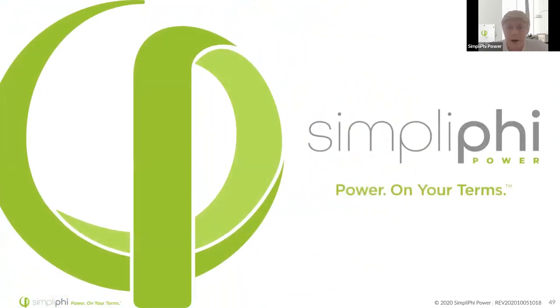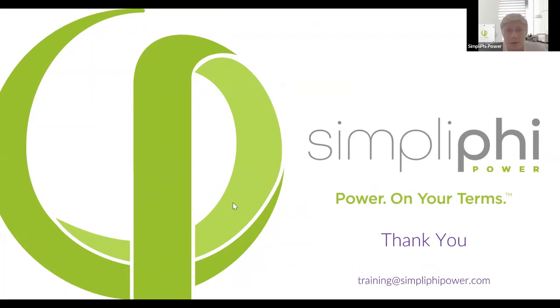Lastly, I want to say thank you. If you need NABCEP credits, now's your time — email me with your full name asking for NABCEP credits, and I'll get them over to you within about 48 hours, so please be patient. Now I'm going to jump into the Q&A. I also found an error in my slides: the slide may have said the open circuit voltage decreases under cold weather, but actually it's going to increase. Your open circuit voltage increases when it gets cold, and if the voltage of the entire string gets higher than what the charge controller can handle, it will most likely destroy that charge controller.